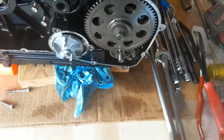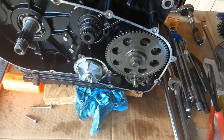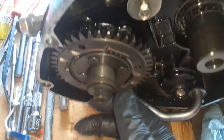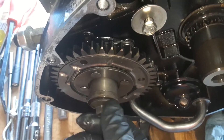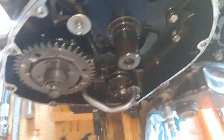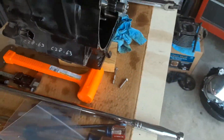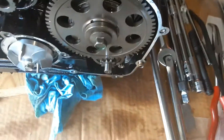It doesn't seem to behave in itself. In any event, that's done - primary gears off, clutch baskets off, rotors off. Left side balancer bolt is also loose and ready to come off. Just want to inspect that starter clutch and see what's going on with that - may have an issue there.